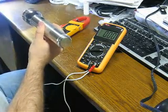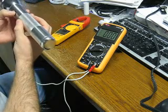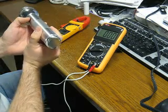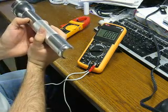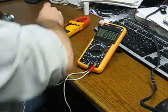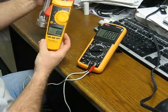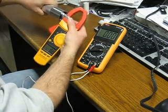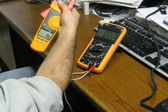Keep in mind this is not 4.2 amps. This emitter, which formerly would only draw under 9 amps of current after having been burned in, is now pulling more than 9 amps of current off these batteries with less than 4 volts open pack. As I turn this on, the light turns blue pretty quickly. I'm going to zero the clamp meter and test the current. Now you can see we've already hit 9 amps and it's climbing as it heats up — 9.5, 9.6, 9.7.